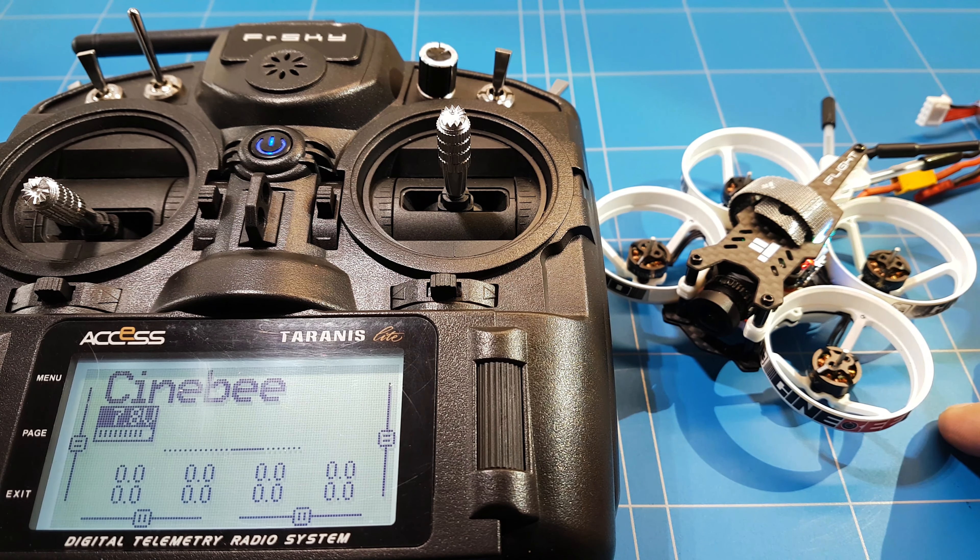Now it is waiting for the next step, which is putting the master switch all the way down. You are hearing four ESCs — it's all in sync. Now they are all calibrated, all the same at 100%. You can be 100% sure about that. That is the nice thing about doing it this way with Betaflight.